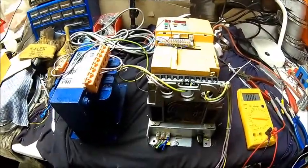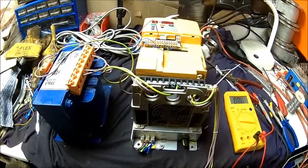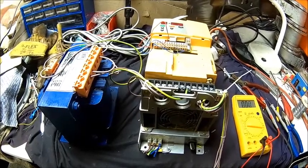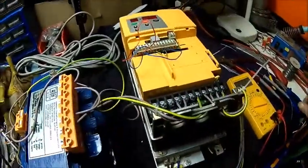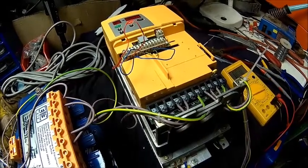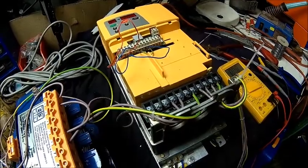So that's the setup for Alan. I'm not going to use this inverter because it's a pricey one with special features. I tried another one — a Siemens — which doesn't really work, so I'll probably buy a Chinese one. You need a little bit more inverter power than your motor rating, otherwise you'll have problems at start-up.